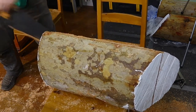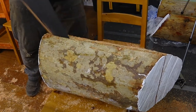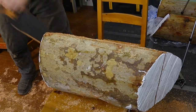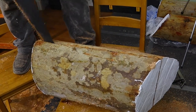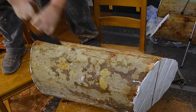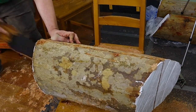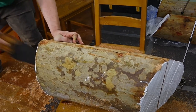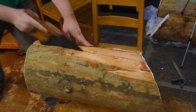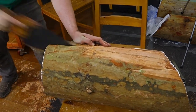I was just by myself, so I was just trying to do whatever I could. My saw wasn't long enough for effective ripping — the length of my saw was maybe two times the width of my cut, whereas ideally it should be about three times longer. But it worked. It was a lot of effort — I was sweating at the end — but I liked the result.